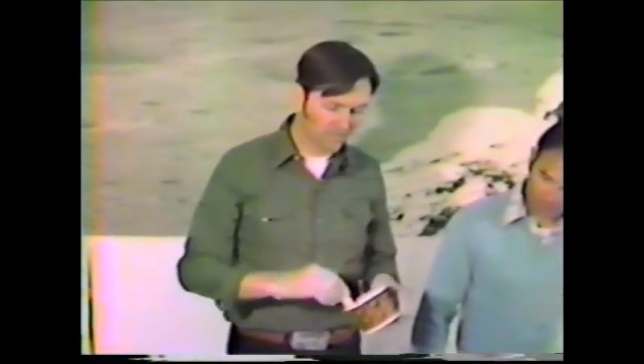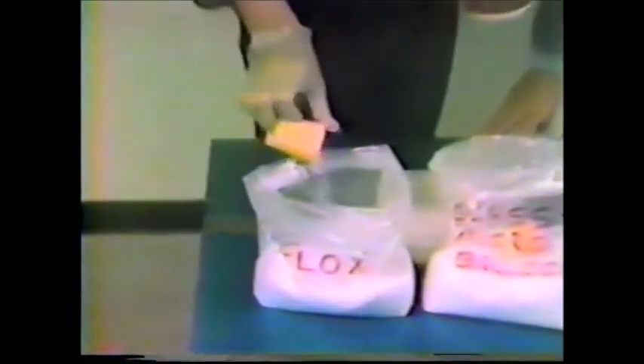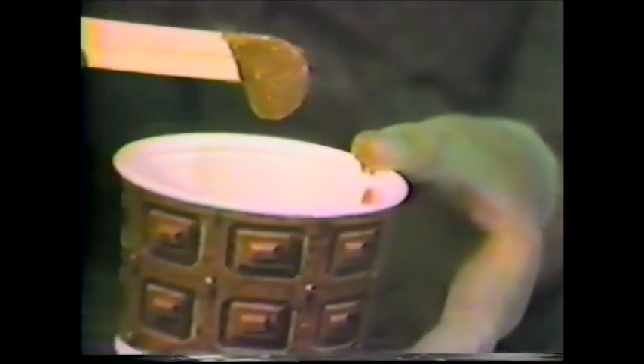Where we need a filler that makes the epoxy mixture much stronger, we add cotton flocks — flocked cotton material — to the pure epoxy. This is called flocks once mixed in, and it is used in structural places as called out in the airplane plans. Wet flocks is runnable; if you mix in a little more flocked material it'll stand up just like frosting — that's called dry flocks. Due to the limitations of styrofoam block sizes, very often you have to join two blocks together.